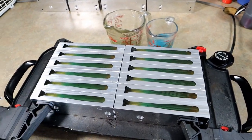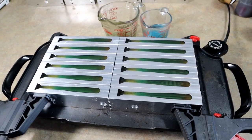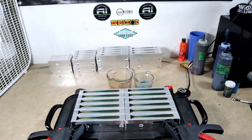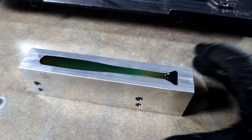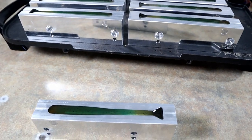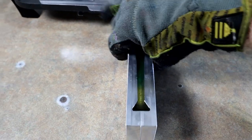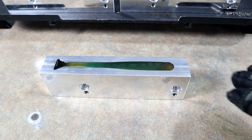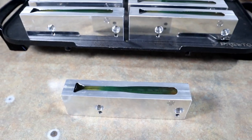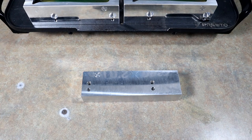I just want to let them sit and come back in a half hour — that gives you the best pour possible. Some people try to purposely over-pour the tops of their aluminum open pour molds to combat the sink, but I think you don't need to do that. Just pour them hot the right way the first time and you'll have that nice even top every time. Pouring hot molds the right way is how you get consistently clean pours. You can see how flat the top is here — there's almost no discernible sink, and that is thanks to heat. As important as it is to get your temperatures right for a clean laminate and a strongly bonded bait, it's also key to getting that top looking fresh and flat. Hand pouring is as much about mastering heat as it is technical ability and color building.